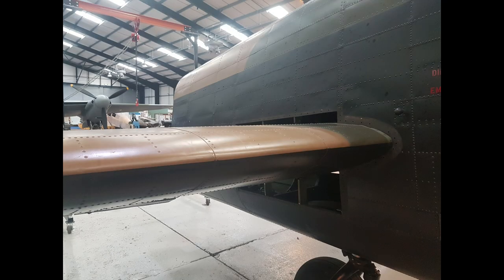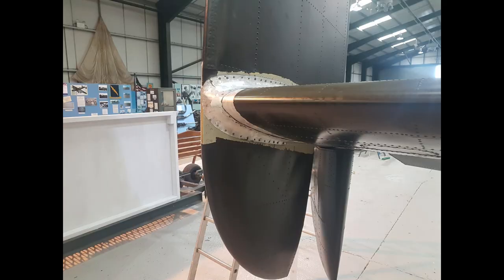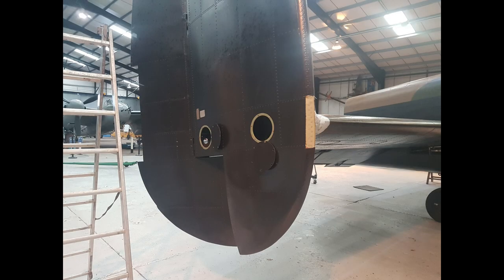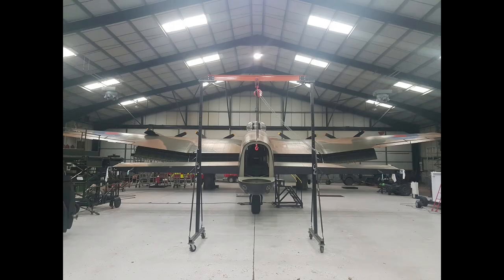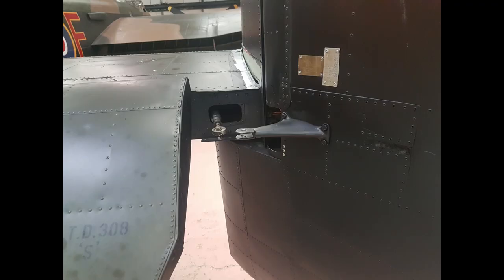After the rear turret is out, John and Jerbs moved on to other parts of the aircraft — namely the fillet panels that go around the tailplane to the fuselage, then on to the tail fins and rudders, and then on to removing the tailplanes as well. The fins come off quite easily; they have fillet panels attaching the fin to the horizontal stabiliser, and a couple of access panels on the outside of the fins allow access to undo the nuts and bolts. The rudders hold onto the fins only by the hinges, so that's a very simple removal. There's also a control rod that comes through the tailplane up to the rudder, which has to be disconnected.